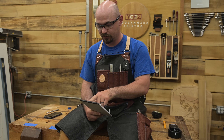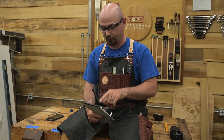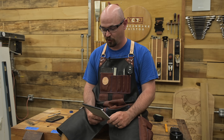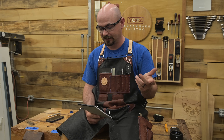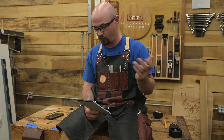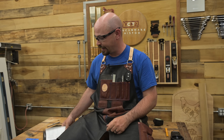We're just going to go with airspeed numbers, since it was through the same opening. The Rockler was moving at 2,992 feet per minute and the Rigid was pulling through the small box at 3,403 feet per minute. So the dust collector was 90% of the speed of the shop vac — or the shop vac was 15% more air than the dust collector. On a small box, the shop vac won.